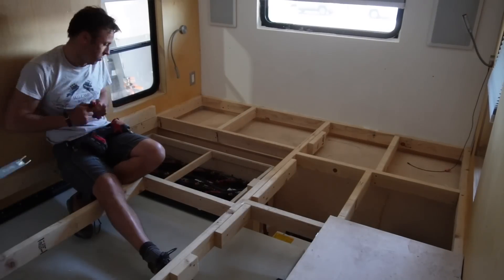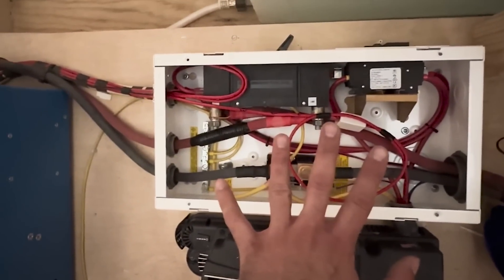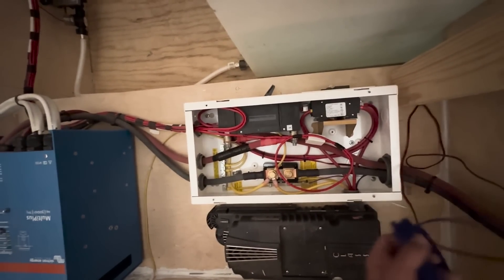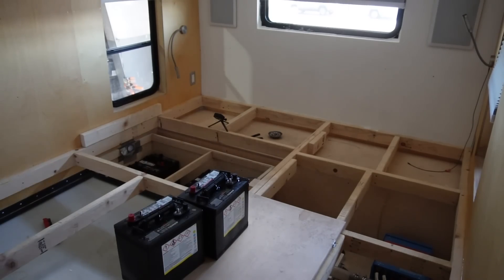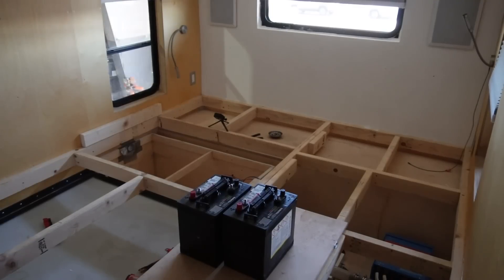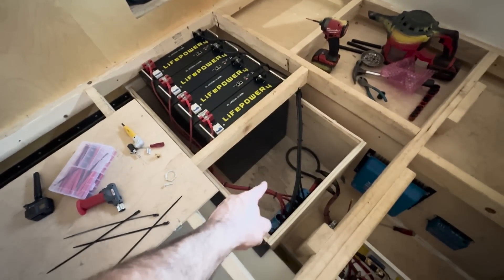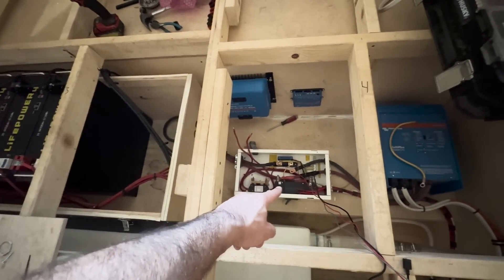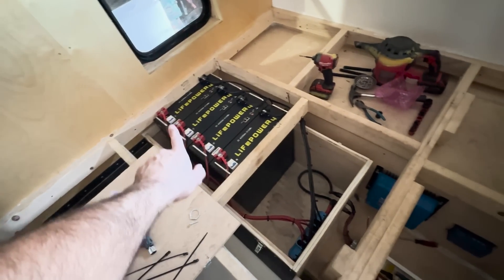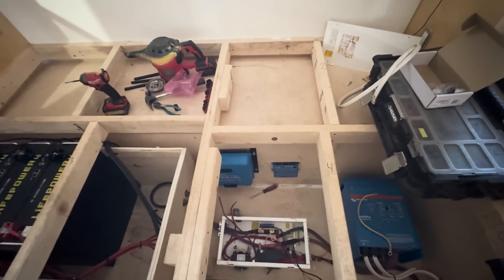It's just a matter of disconnecting the output of these breakers and putting in new wires once we get this out, connecting those up to where our charge controller will be mounted, and then we can put this back together. We're also going to go ahead and get rid of this temperature sensor because we don't need it — these batteries have their own BMS so you don't need to worry about their temperatures. We've got the charge controller mounted, the Cerbo mounted, just need to run our wires and then we've got our batteries wired up and feeding power in. As soon as we get this connected we'll throw the breakers and power the system up.